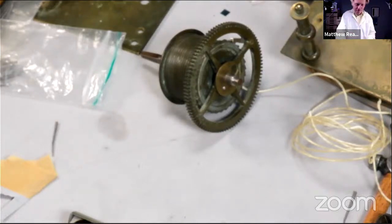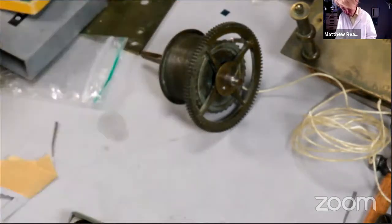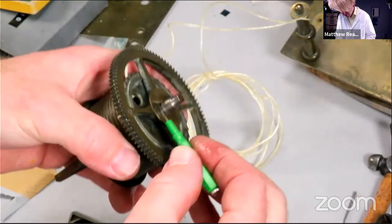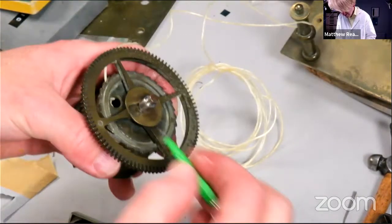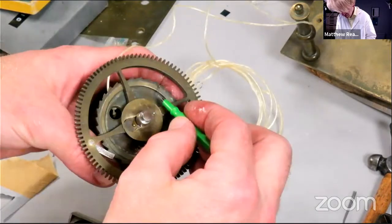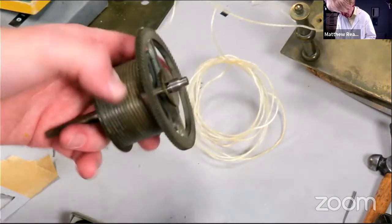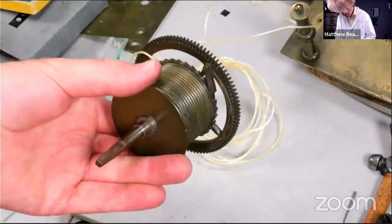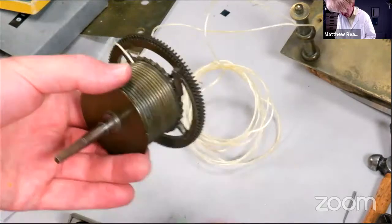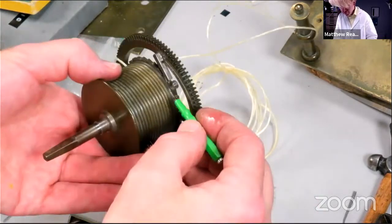Obviously, this is all incredibly temporary just to get it working, but you should oil it nevertheless. So a bit of oil in there behind the slip washer on the bearing. A couple of drops on the face of the great wheel, click where it touches the ratchet, click bearing and click spring where it touches the click. Okay,